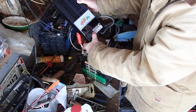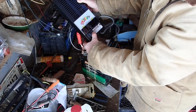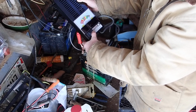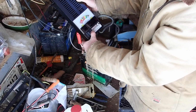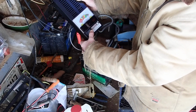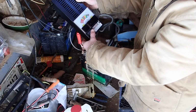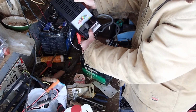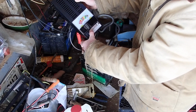Yeah, so showing very bad. Interestingly, it is increasing in voltage, though, and it could be that even the fluid in the battery that I just put in needs to mix in a bit more. It's actually creeping up as I leave this on, interestingly. 6 volts now. I mean, it should only drop down to, say, 10 volts when you put that load on it. So now the overall voltage is showing 10 volts, and it goes down to 6 volts. So that's definitely a bad battery, end-of-life battery.